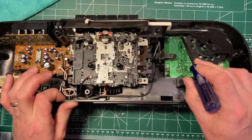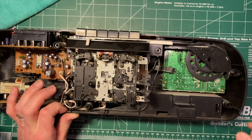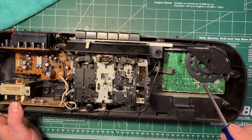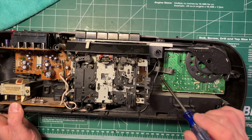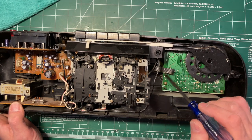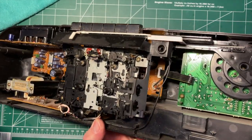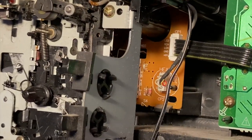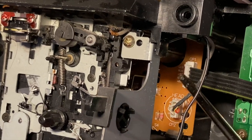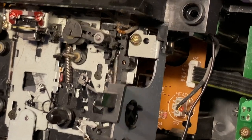Let's see, we can see this is the band switch, and we can see FM stereo, FM mono, AM. It's all labeled nicely. We don't need to remove that. Everything is modular in these kinds of things. So you see there's the radio, and that hooks up here. I'm going to turn this and maybe zoom in so you can see that that's also labeled. If you look at the back of the cable, it's labeled LED, right channel, left channel, ground, and 5 volts.